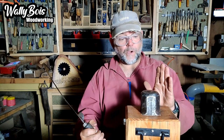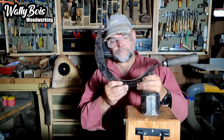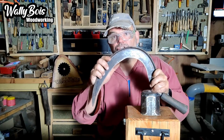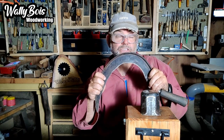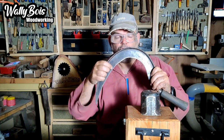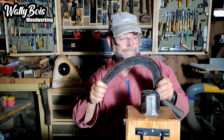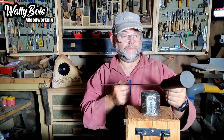This is my peening anvil. Now what peening does is it draws material from the stock of the blade to the edge, and you can use that to fill any lows and highs that might be in the blade. You can also use it as a way of repairing the blade — if you've got a little crack forming, you can draw material into it and literally remove that crack or the start of a little tear in the edge of your blade.